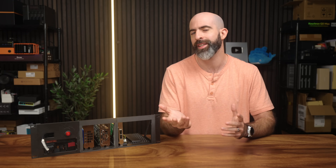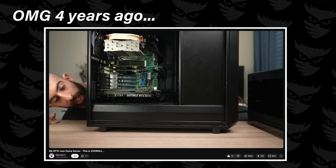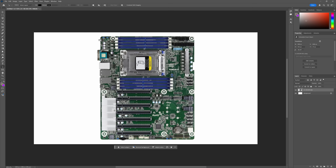But wait, that doesn't really sound like a problem. Well, that in itself isn't — the problem is physically using all of those lanes. Let's take my main EPYC-based server that I've been running for a few years. That setup has 128 lanes and seven physical x16 PCIe slots to utilize them. And if you look at the board, you'll see that for a standard ATX board, that's pretty much the maximum amount of slots you can get, and they don't have any vacant slots in between them.